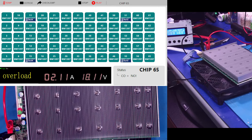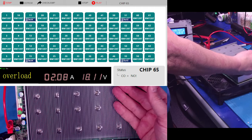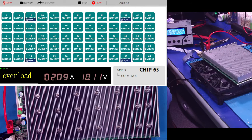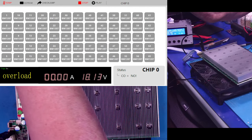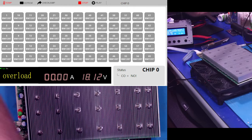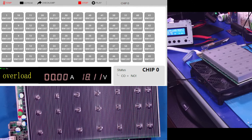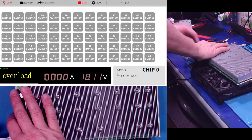All right. Well, wow, look at that. Now it's down to 2 amps. So we're really just chilling. With those heat sinks on now, we've dropped the overall operating temperature of the chips. That's a good sign. So hit the hash test button to stop it. Put my power leads back up. Probably shouldn't be clipping them to the there. Okay. Cool, cool, cool. And make a little bit of room. Turn this off.